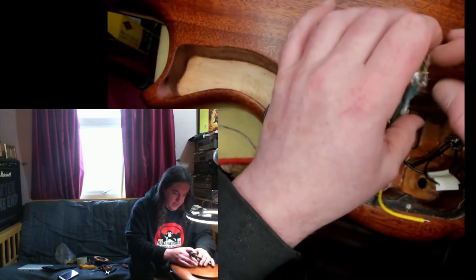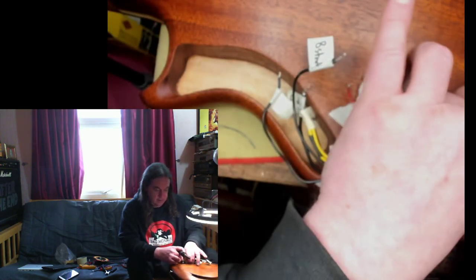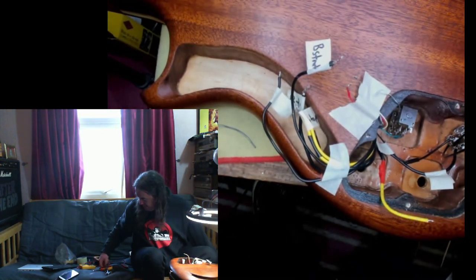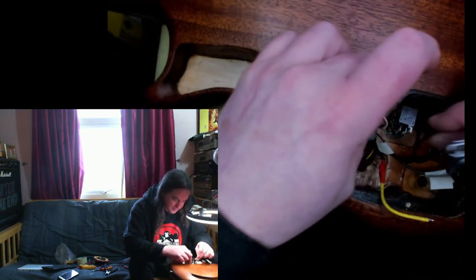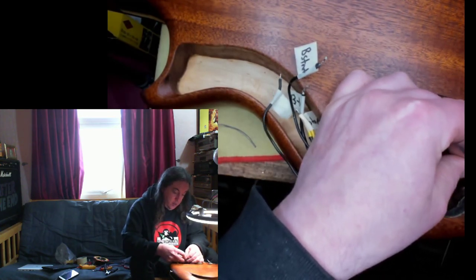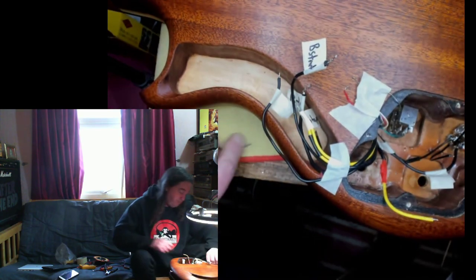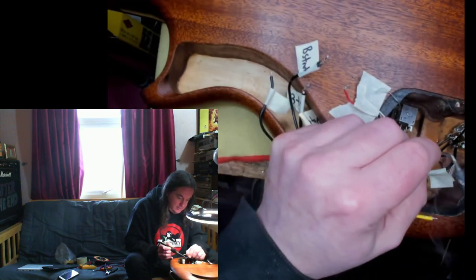This is the output, so this is going to the switch — going in this one here. Bang, output in. The two wires coming off this one — one is a tone. Does it need to be as long as that? I'm trying to keep it sort of neat. How long does it actually have to be? I'll take a wee bit off. I've got a big pile of wire now so I can afford to. You can run the tone from the in or the out of the pot. There's not one wrong way — there are several right ways and several wrong ways.